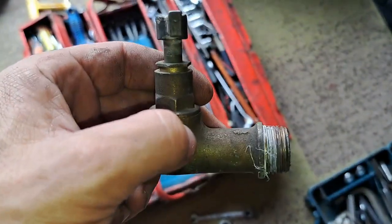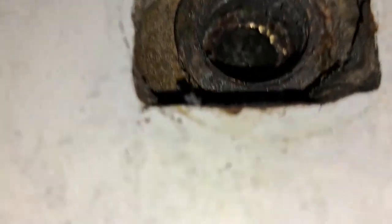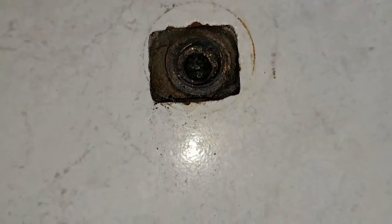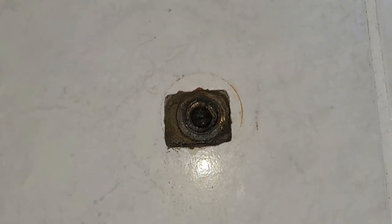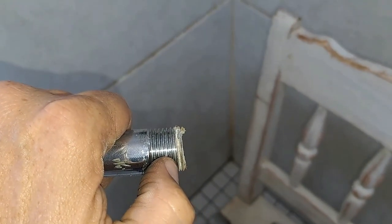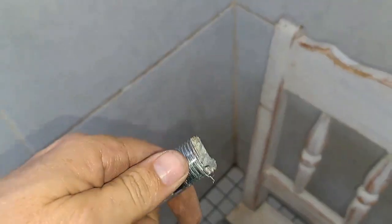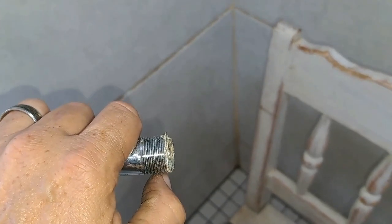It's working better than I thought - it's not even damaging the thread. What's nice about the maneuver I'm doing is that while I'm cleaning the thread with this tap, it's even breaking out the old pieces of that old head. So I'm going to continue doing that until I can't turn it anymore. Then we're going to put that other shower head back and see how it looks. I might have to take a saw and saw this piece off and start putting it in at the new thread, just because it's broken - I think it'll be safer if you can just saw it down straight.